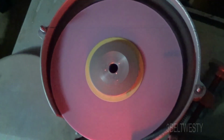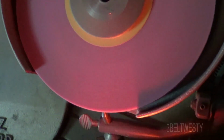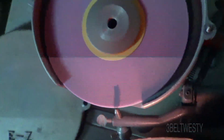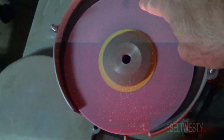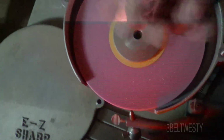Of course, once you start to grind on a skate, this will go through and slow way down. But if I go down here and go to 1800 RPM, I can get the reed not to move. So I don't have to use the dial. And you have a false image. This mark on here, if I make it stop, is actually going around twice.